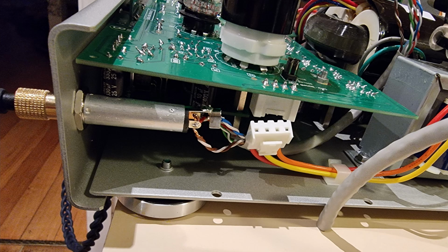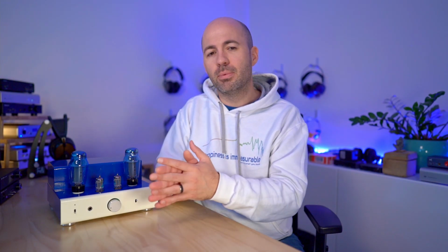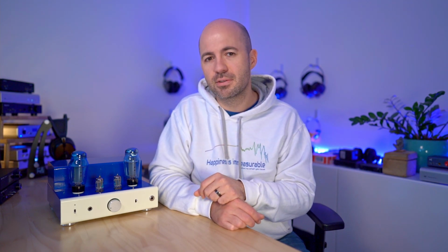From there though, I also had to find a way to add the resistor network required to bleed off some of the power without increasing the output impedance. Otherwise, we're right back to where we are on the stock output. So after much playing around, what I ended up doing was using a set of high quality Mundorf resistors and installing them in an L-pad setup.